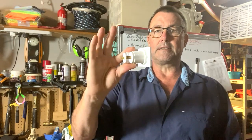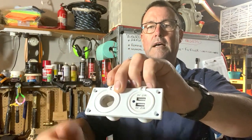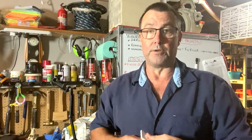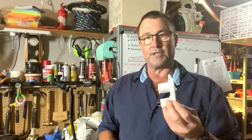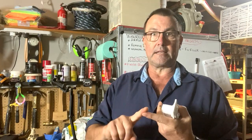We've got the original start battery that was in the boat, but we've added a 105 amp hour full river brand absorbed glass mat deep cycle battery, and that's going to power all the house loads — your lighting, sounders, stereo. This accessory port that came in the mail yesterday has a cigarette-style power outlet or USB. It's going to a gang of six switches; all the others are for running lights, anchor lights, cabin lights, deck lights, and hold or engine lights.